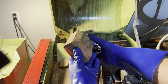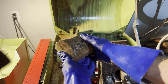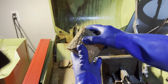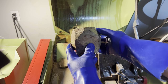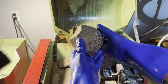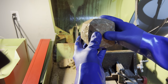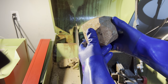Now we've got this done on two different sides — it's starting to look a little like a sphere. But what I'm going to do next is start chopping off these angles. It's starting to look like a sphere, and at this point I could stop and take it to my carving machine and grind down these peaks, or I can put it back in the slab saw and make a series of smaller cuts — which I think is what I'm going to do.